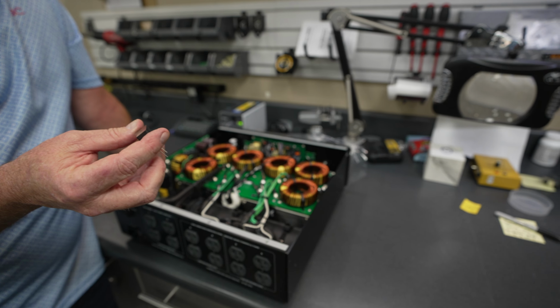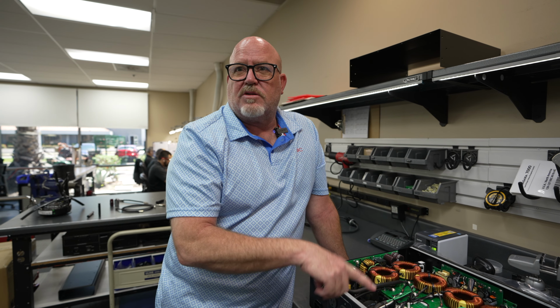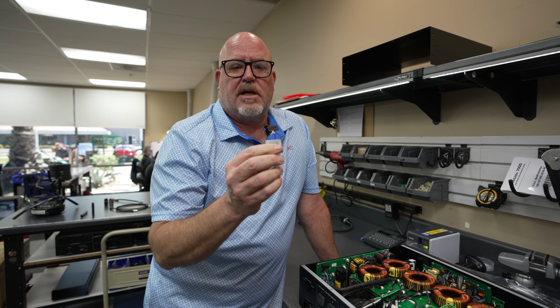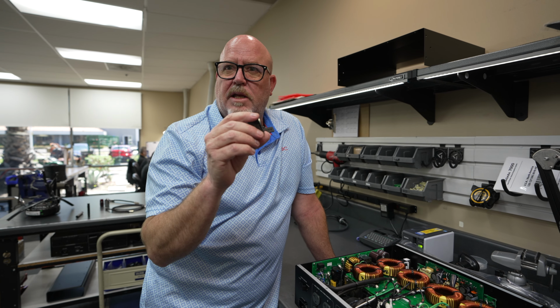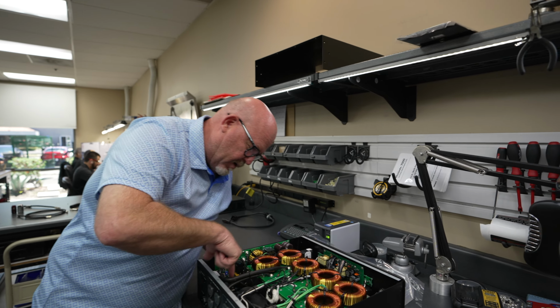We've spent a considerable amount of investment. I think it took us a full year to cook enough caps to do the first run of these. So 24 hours a day we cook these things. They'll cook for 24 hours at a specific voltage, and that's determined by Garth, depending on which one we're cooking. And we cook them all the way down to the little guys that are in here in the back. And every one of those makes a difference.